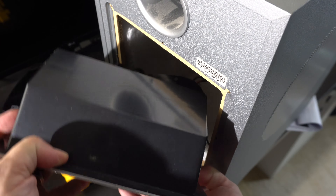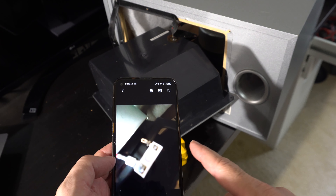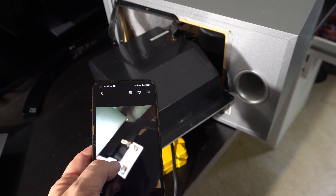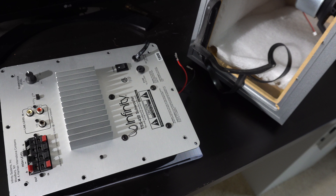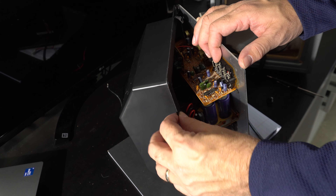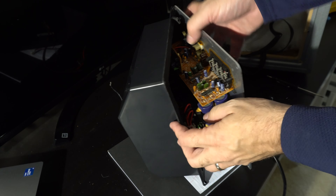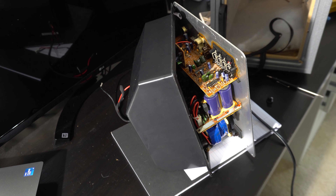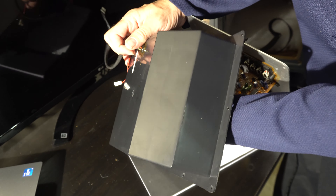First thing I had to do is remove about 14 screws — there's an outer ring of screws and then four screws on the inside that hold the amplifier plate to the back. I did this wrong. There is so little slack — whoever put this together put so little wire in there. There are cables that attach the speaker and cables that attach the front LED, but it was sort of glued and stuck in. I ended up actually yanking the LED cable and the negative speaker wire out because there's just so little cable available, and ended up using the selfie cam on my phone just to see what the situation was in there. They're just push-on connectors on the speaker.